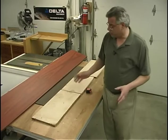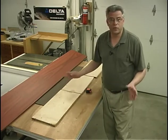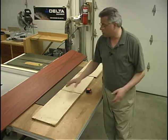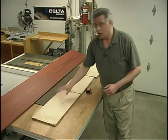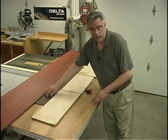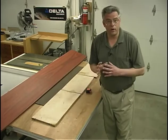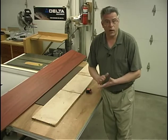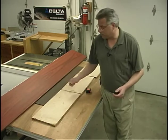While it's certainly possible to construct this clock out of any woods that you'd like, I myself have chosen some nice contrasting woods. Throughout the construction you'll see we're building two different clocks — one will be primarily out of bloodwood, the other primarily out of maple. I have three species: hard maple that's highly figured, wenge, and bloodwood. Bloodwood is a very dark redwood, very finely textured. It looks very similar to padauk but it isn't open-grained like padauk — it's much more finely textured, a very hard dense wood, and it's used in flooring applications.